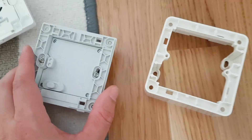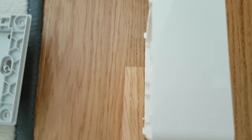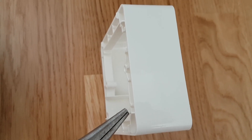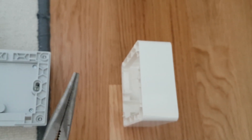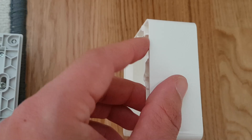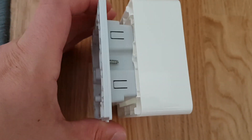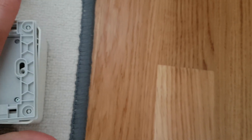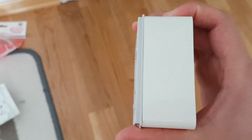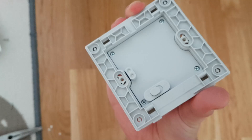Here's a pro tip. If you look at this spacer, it has small edges. You can break them off by using pliers — just hold it and wedge it back and forth to get them off. If you don't remove these small little notches, the thing you put in here won't go all the way in — you'll get a gap. So it's important to remove those edges. Now you see it's a nice fit inside this box.